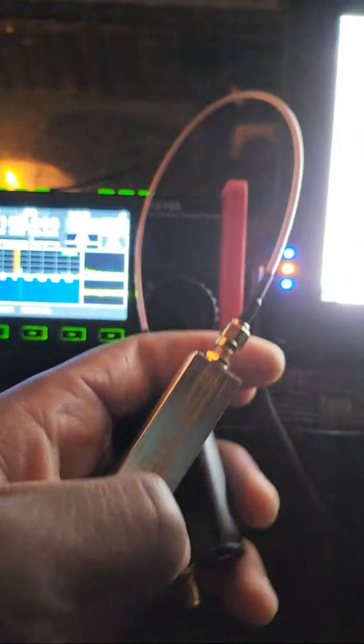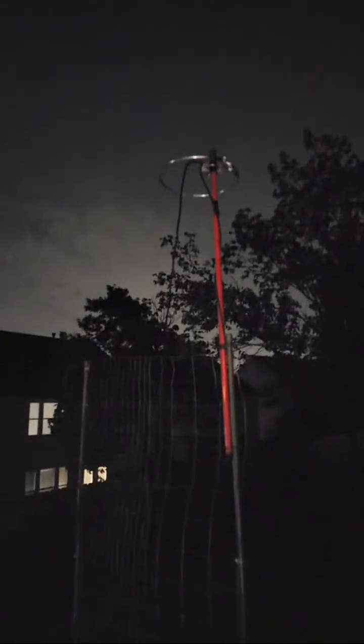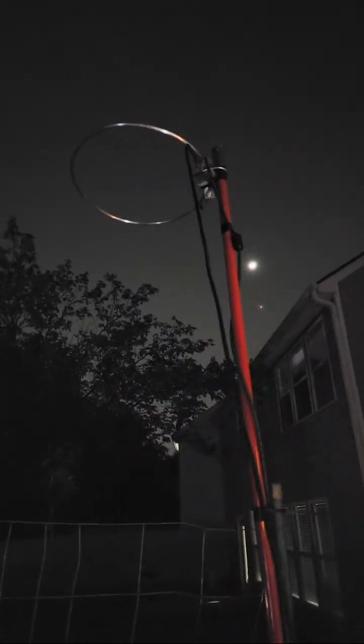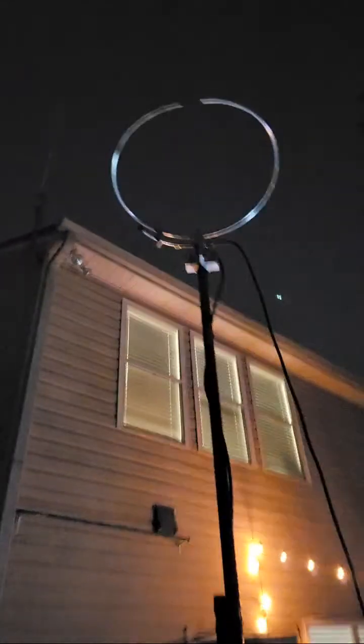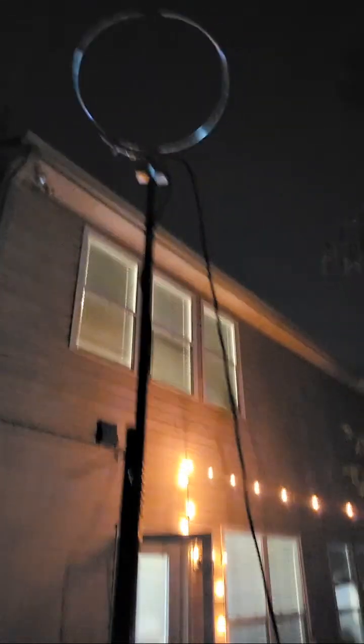Here's an idea of the antenna I'm running to start with — it's a circular 137 MHz antenna that I mounted on a broomstick and fashioned some coax onto so I can receive satellite images. Earlier I was picking them up on the Diamond X200 and getting decodes, but tonight I wanted to refine it. I'm now running a low-noise amplifier and a filter specifically for 137 MHz to get better decodes and pull down crisp, clear weather data images.